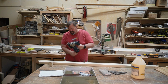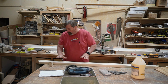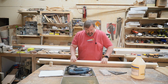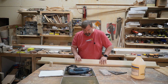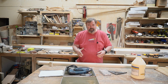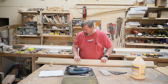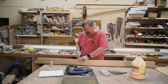So as I'm cleaning up and getting ready to hand plane our window stool here, I got to thinking, before I do that, I need to create a wide, or a really long or deep, rabbet on the bottom side of our window stool. If I plane this all down and we create a crown, it's going to be hard for me to run this through the table saw and fit this to the bottom part of our rough opening. Our window stool overall is about 1 5/8 inches.